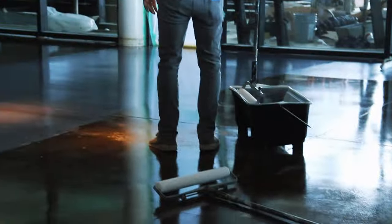Sometimes you'll even back roll, depending on the material and the environment. On Ballast Point it was really hot in there, so we didn't have time for that. But if you have enough time, it's best to have a guy on spike shoes walking from one side of the room to the other, rolling wall to wall — that way there literally can't be roller marks. We couldn't do that on this one because it was cut up with walls for different booths and a lot going on.